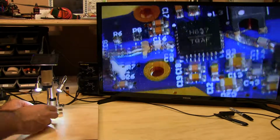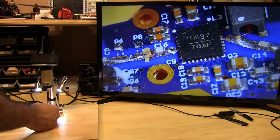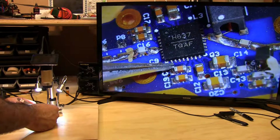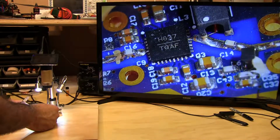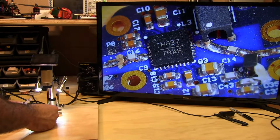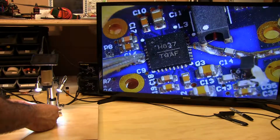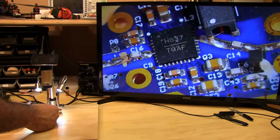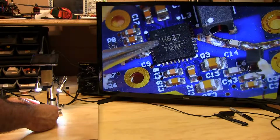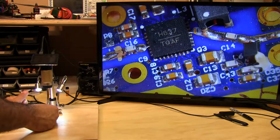So right here you can see there's a slightly smaller QFN that's been soldered down, and on the edges you'll see the solder fillets come up and stick to those copper edges. Now manufacturers will state in their data sheets that this isn't a legit way to fully prove that the part's been soldered correctly, and they actually don't recommend that this is the primary means of connection of the chip.